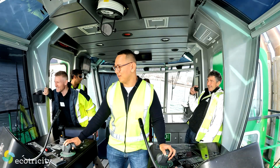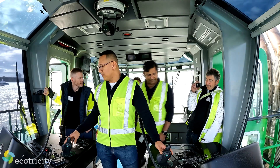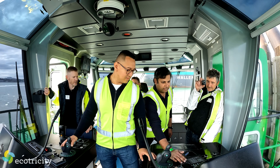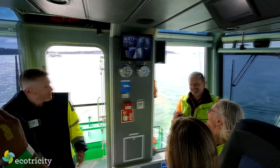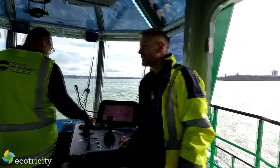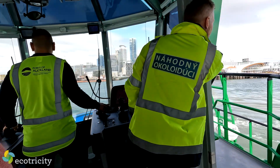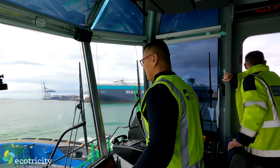The alarm activates because you went over five knots — it's the bridge navigation watchkeeper alarm, like a dead man alarm. Every 12 minutes it checks: are you alive? It activates when going over five knots, asking if you're intending to do that. We put Sparky through its paces, spinning around the other way, and despite it being 12 meters deep here, we churned up the silty sea floor with its three-meter diameter propellers, followed by a final party piece called a stern-up flick.